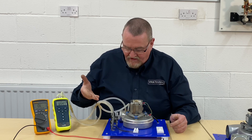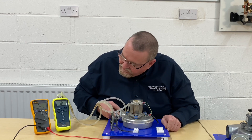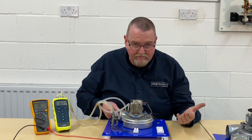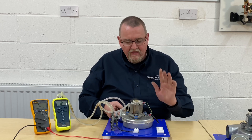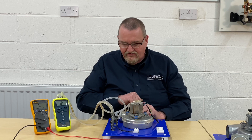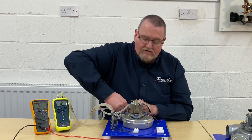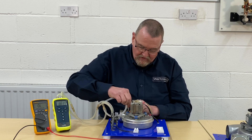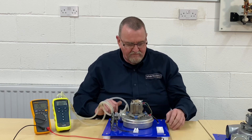We've checked that's working. Now if I block the Venturi off using my finger, we can see the pressure drops off — the pressure's disappeared. That's because I've blocked the Venturi. One thing that occasionally happens is we take tubes off to fit new components and get them crossed when we put them back on, because it's easily done — we've made a mistake and got them on the wrong way.